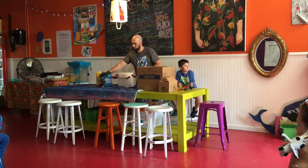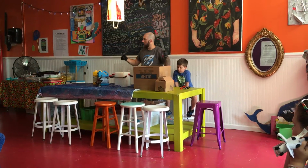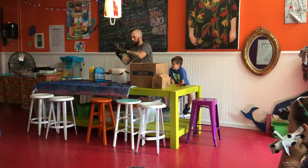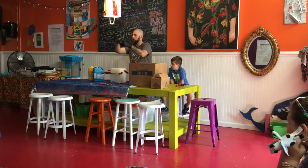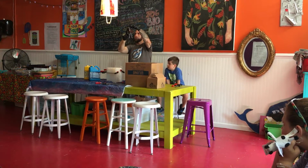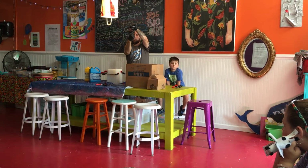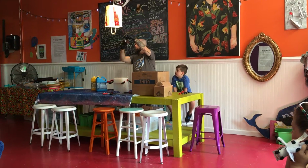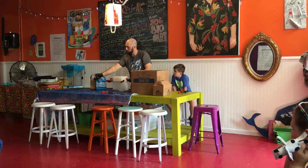A lot of it depends on how intricate the sculpture is. There's little divots here. When I pour it, I'm going to have to rock the mold a little bit so that the liquid comes down, and when it comes into this horn and these little spikes here, I need to rock the mold to make sure the liquid goes up into the divots in the mold.